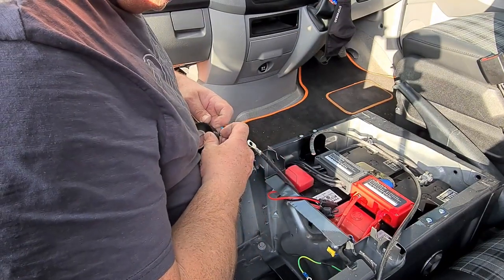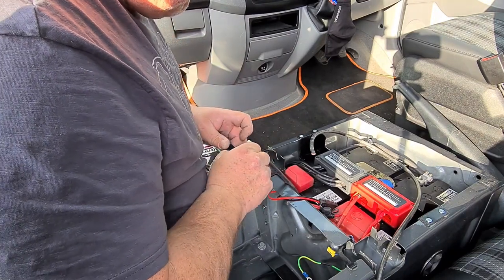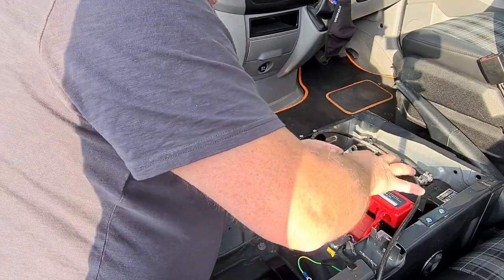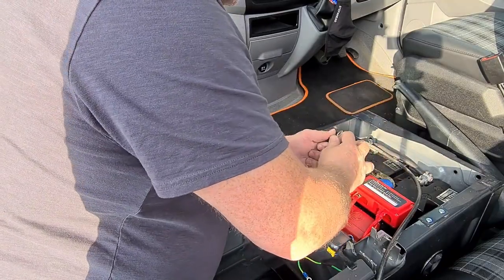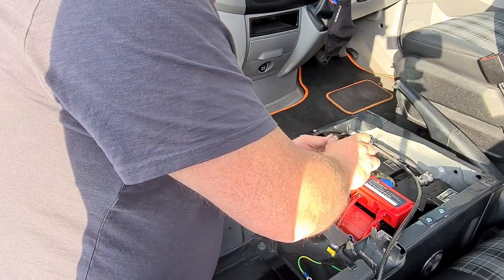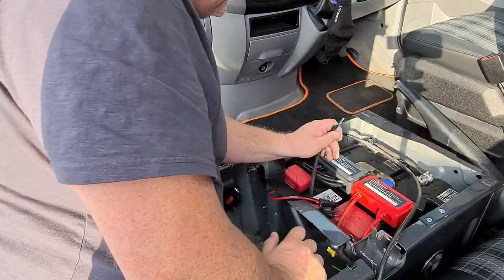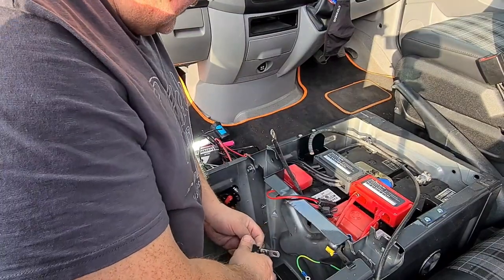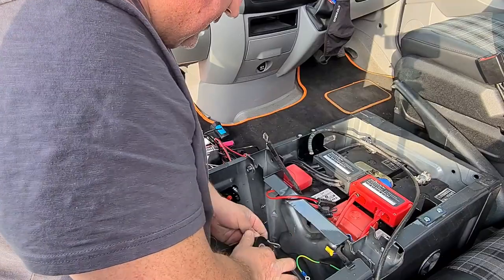The cables came with the kit but they're only 16mm. I've decided not to use them — I don't think they're adequate for this system, even though it's only over a short distance. So I'm making my own. I've got some cable left from another job. I've just run the cables around, got them to the required length, and I'm just crimping them off now.